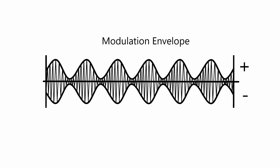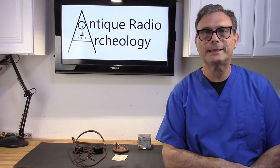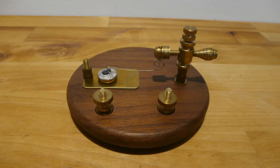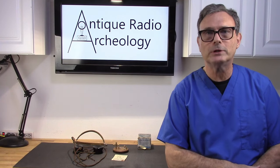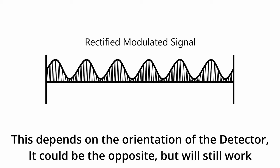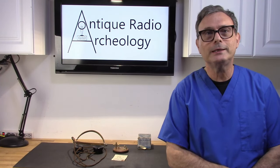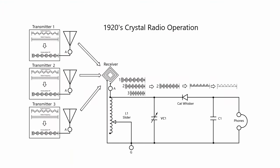The modulation envelope creates both an inverted audio signal and a positive audio signal — the outer edges of that envelope are your audio. If you put a set of headphones directly on the received signal, you'll hear nothing because the two signals cancel each other out. So what you need to receive a radio signal is a detector. That detector can be in the form of a crystal, and what it does is allow only the positive side of that modulation envelope through — the negative side is rejected. Once that happens, if you put headphones on, you should theoretically be able to hear that audio. There will be RF mixed in, but you can't hear RF, so it won't affect things much.